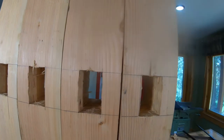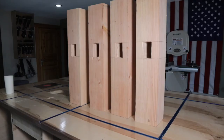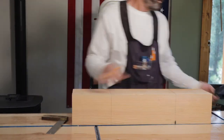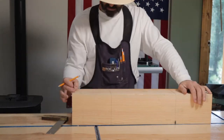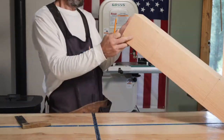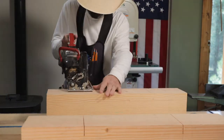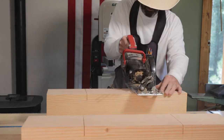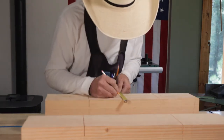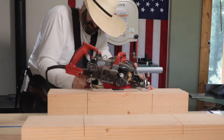They were pretty rough, so I had to go in there with a rasp and a custom sanding block and clean them all up to where they're going to work a little nicer. I then make the tenon by using my skill saw and setting the depth of the material to be removed on each side. I cut all the sides and one side was a little shallower than another, so I had to make sure that measurement was correct.